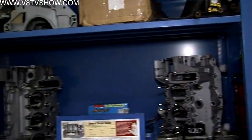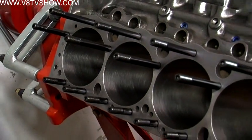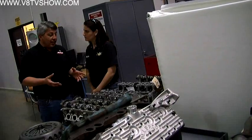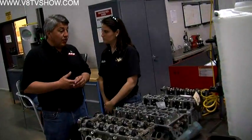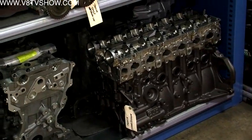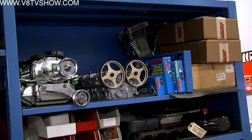After the calibration room, we moved on to a room full of engine blocks and other engine parts. What they do is bring in a cylinder head or a block, look at the stock production fasteners, buy new factory fasteners, and test them — figuring out how strong they are and how they were designed. Then they re-measure the head or block to see if there's an area for more thread engagement or if they need to change the undercut diameter thread to allow for more expansion. Everything for a new kit is done with the actual engine or part on the shop floor, with all R&D performed in-house.